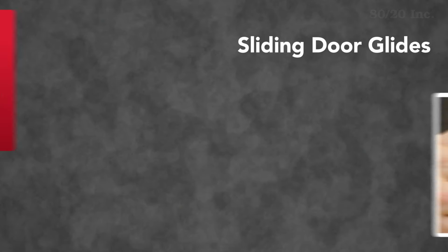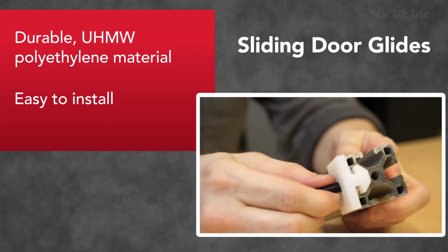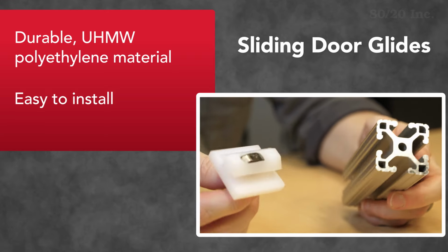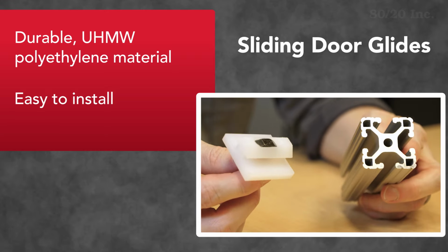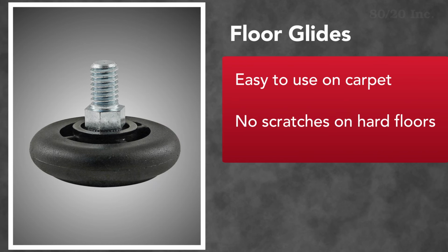Let's take a look at some of the products we decided to use in this project. We'll start with the sliding door glides. The glides in this assembly are made with UHMW polyethylene and don't require lubrication. We'll be using these to allow movement for expanding and collapsing our tabletop. For the base of the table legs, we've chosen floor glides. The glides have a hard plastic bottom, which is easy to slide across carpet and won't scratch hard floors.